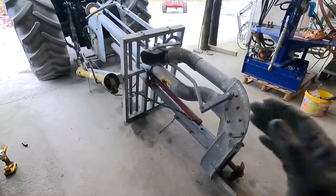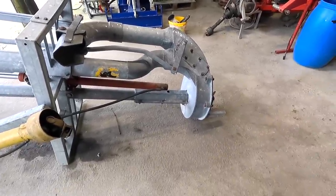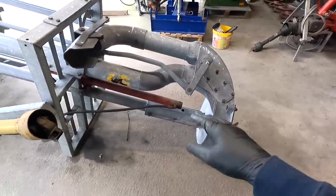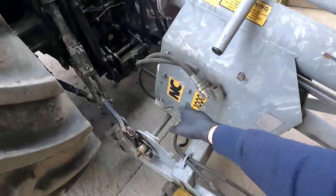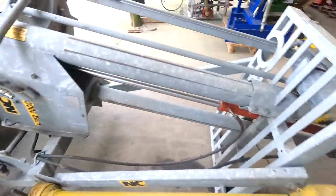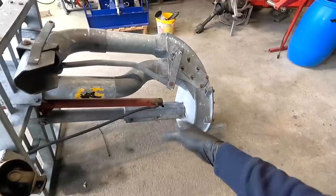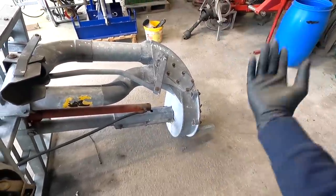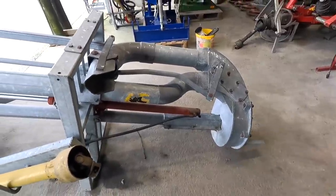As I said before, we're going to address this seal problem here now, and I've never done the seal in one of these before. It should be relatively simple, but what's happening is there's a lot of slurry going up the stem between the shaft and the cover, and it's making its way up ever so slightly and coming out just at the top. Now, there's two reasons for that. It could be that the seal in here is worn. It's just a little rubber sleeve, that's all it is. Getting the old one out might be a bit of an issue, but hopefully it'll not be too bad.